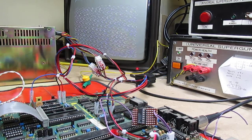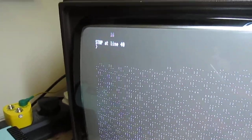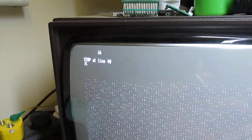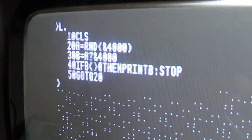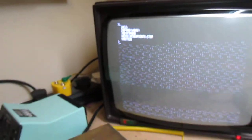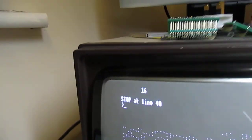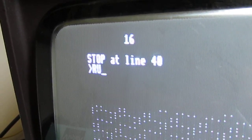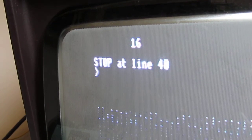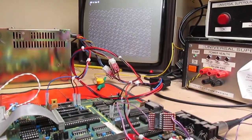As soon as we run that it stops and gives me a value of 16. Running it again it stops at the same thing — 16. That tells me those locations are reading 16 instead of zero. 16 in binary is data line 4 — D4.